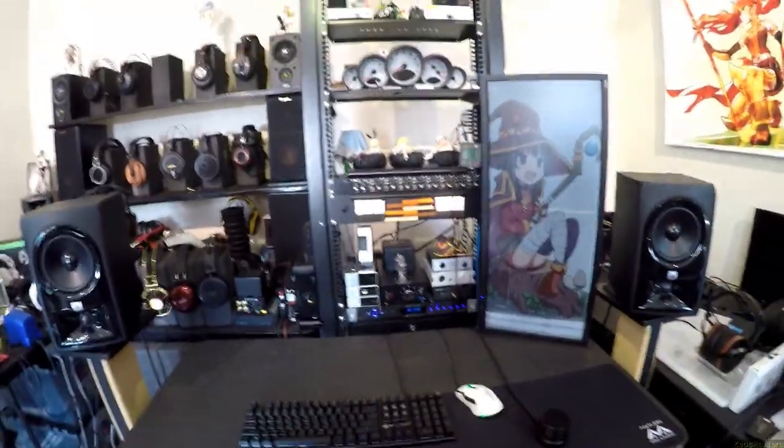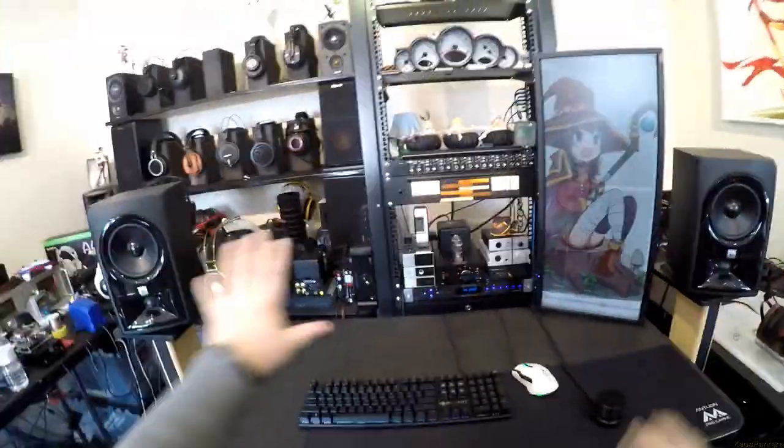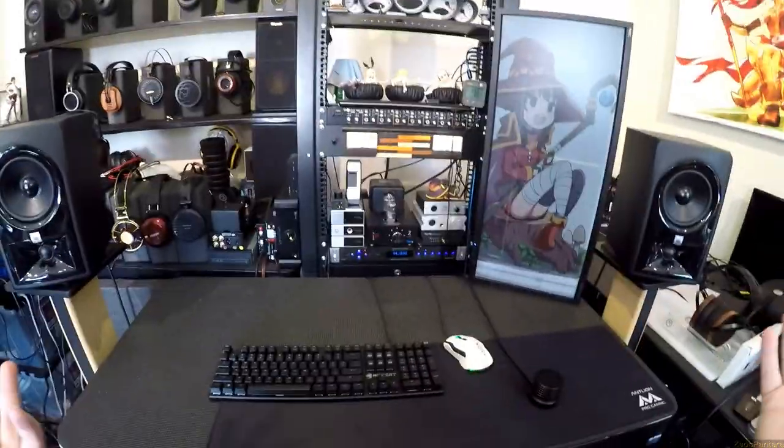To adjust it, if you're listening and your speaker heights are perfect, and you're still hearing vocals coming from up, push the tweeters down. And people are going to say the phase alignment's going to be all wrong. I don't care. I'm not mixing music. If that has something to do with mixing music and phase alignment's the problem, then they need to be tilted.